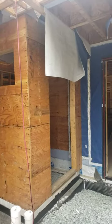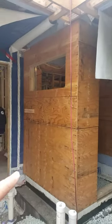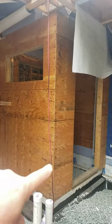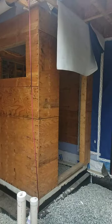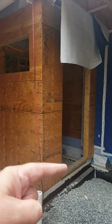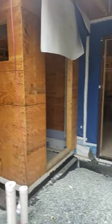Here's some really good proper planning in advance. This is a little vestibule here. The conditioned wall is this wall back here, and then we have this unconditioned vestibule that basically is the transition space from inside to outside. When you open this door, that air doesn't rush in and fill the house — it just fills that little vestibule.